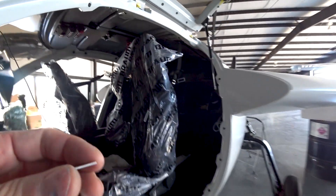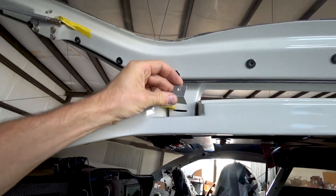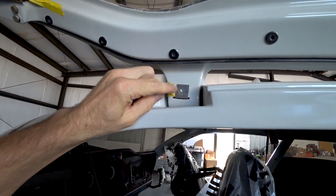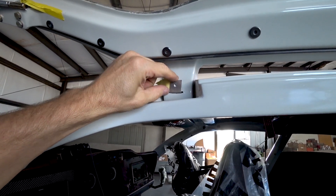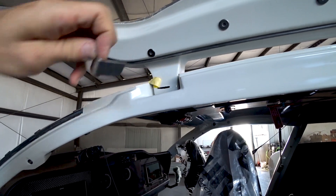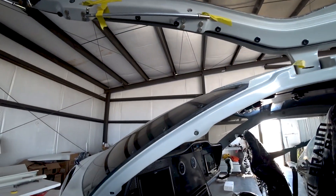Welcome back. Second half of the week — just a quick job I got halfway through: these little tabs that hold the pins for the hinges in place, to stop them from sliding inward. They need to be drilled and tapped into the door frame, with some screws to hold them in place.